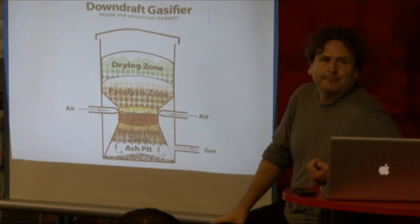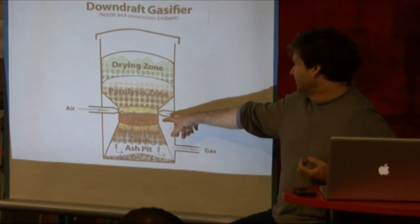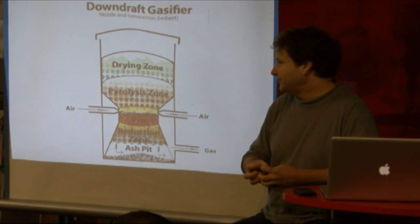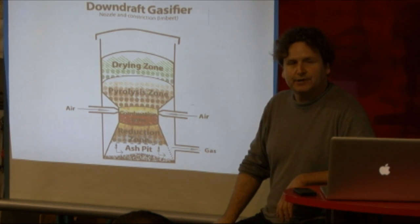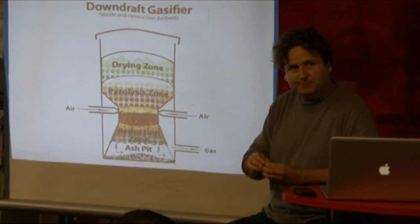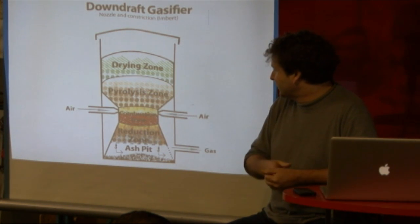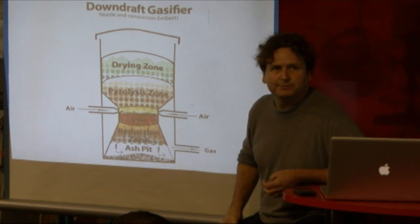This material here is some sort of chunky fuel or void space. The gas is passing between the fuel, which is one of the fundamental problems we'll get to in a moment. The combustion and cracking is happening in all that void space between the fuel. As that void space changes around, your space for the combustion and cracking changes — the production reactions change — and it introduces other problems.